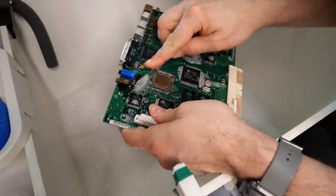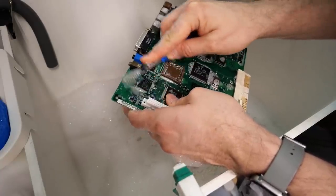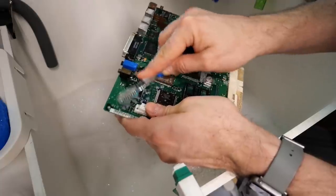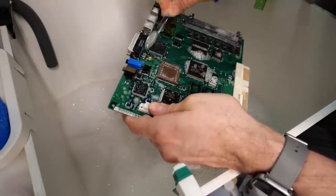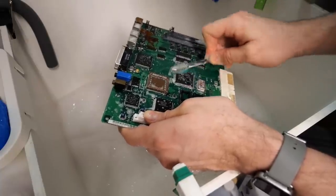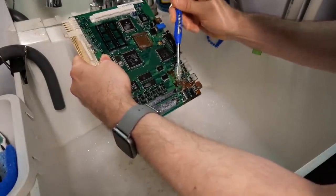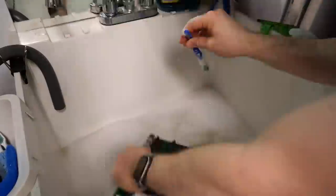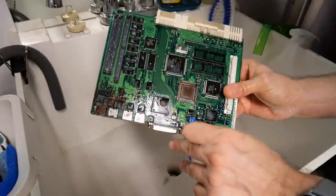For boards like this that might have had just leaky capacitors if the battery hadn't leaked, I like to focus my scrubbing right around the whole areas and the chip legs where it might have been affected by the leaking electrolyte. That just seems to get up as much of the electrolyte as possible. And you just sort of scrub away and look carefully, keep rinsing it until you see it starting to clean away any of that fluff or any other junk that you might be seeing on the traces or on the legs of the IC. Definitely this scrubbing actually is having an effect on this rusty part here — it is removing it, some of it at least. I think I've scrubbed this as much as I can.